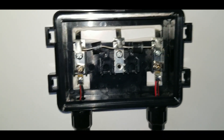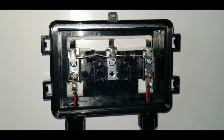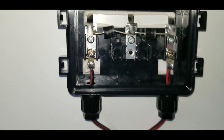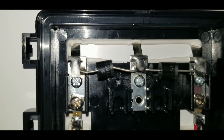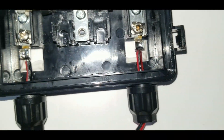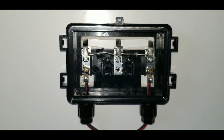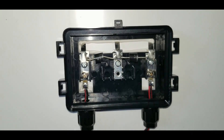I looked them up and they seem like decent quality — they sell them on Amazon. There are two of them, rated over what the panel puts out in amperage, so whether they're 15 amp or even 10 amp, it's still over the panel's rating and will block any reverse current. They're connected with standard Phillips heads on some type of bridge. You can see the silicone sealant used all around the box — that, along with the O-ring, gives it the IP65 rating. It's probably not fully waterproof against high-pressure water, but adding extra silicone would help.